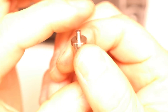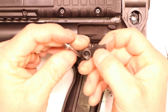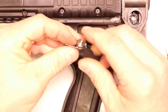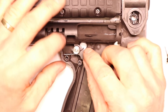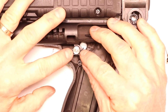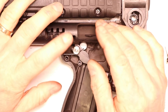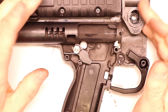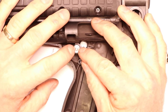This is just a quick sneak peek on another component for the sub to give you that extra reliability and function. It'll simply drop in to everything else — you just drop in this complete assembly. You don't have to worry about making sure the bushing is at the appropriate depth. In some of the earlier videos I'd have to explain in detail for a couple minutes to push down on that plastic bushing until it's completely compressed. Always a gray area — people would say they pushed it down and it felt like it was in there, then get it all together only to find out the sub's not functioning. Which is a huge disappointment. And it would always come back to this hammer bushing.